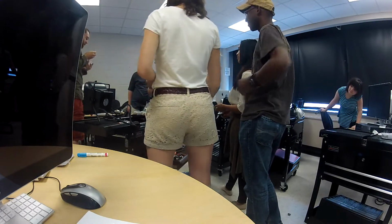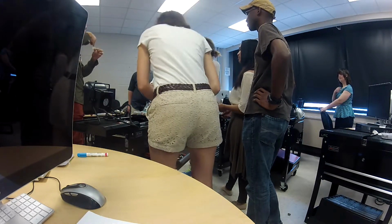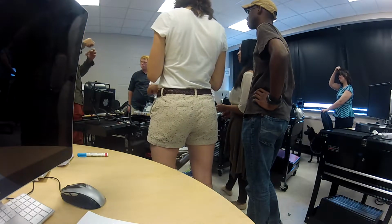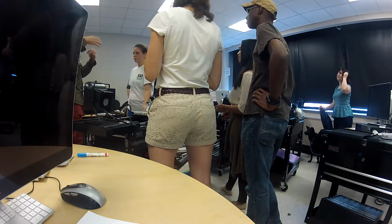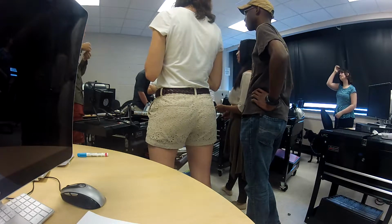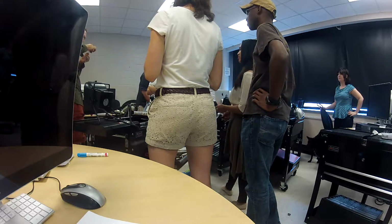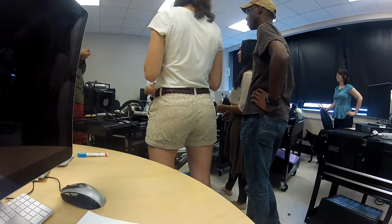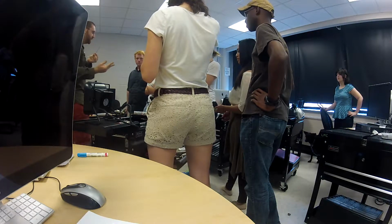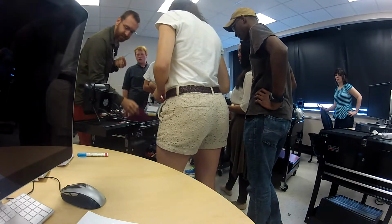Usually you'll have wires going into something, and you want to make sure that the connection where you solder them doesn't get shorted or break. You want some extra protection there. Right now I'm just folding up this wire for example. You would put your little heat tube in there. Anyone have scissors? Or maybe just an X-Acto knife.